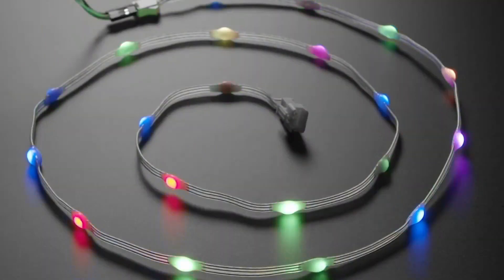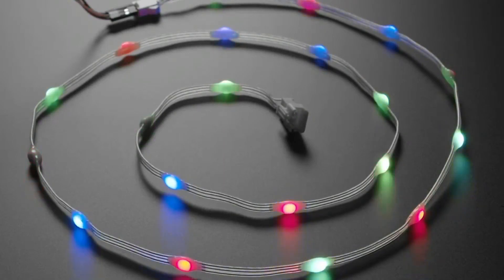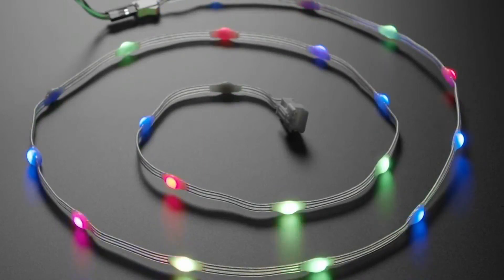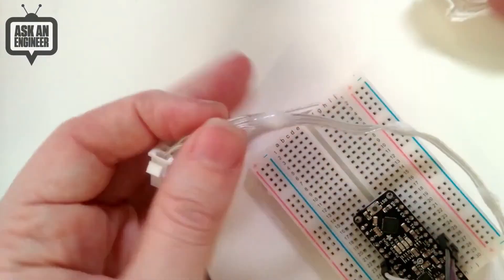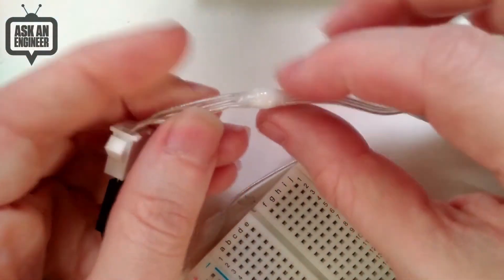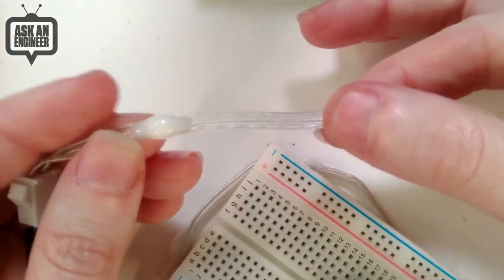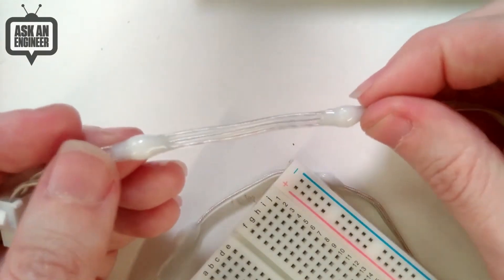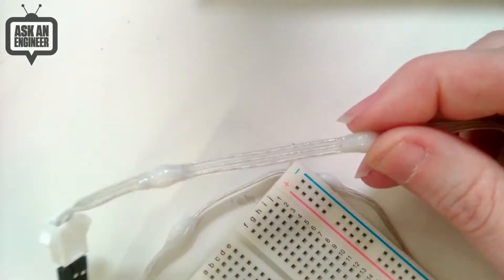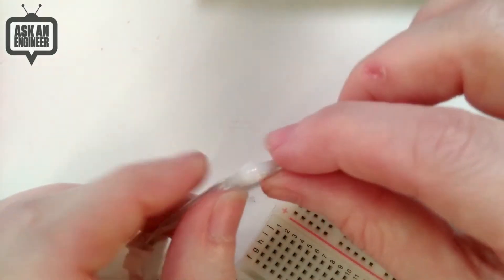Next up, Lady Ada. We've got some more NeoPixels coming your way. People really like the NeoPixel dots — they have kind of a weatherproof casing and wiring — and people also really like the fairy light versions of NeoPixels. This one is kind of in the middle. It has a little mini NeoPixel, and the wires are coated with PVC — they are not bare wire, so they have a little more weatherproof resistance. Now they're not rated for dunking underwater, but this is epoxied and PVC-coated, so these are much more durable than most NeoPixel strands. They're much smaller than the dots too — they've got a nice small look and glow quite nicely through the milky epoxy.